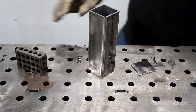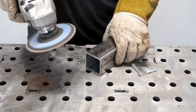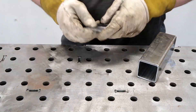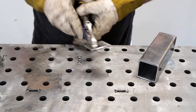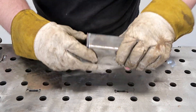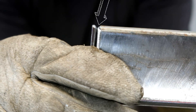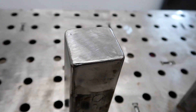Now for the proper way to execute our top or outside cap: bevel or chamfer all four sides at about a 45 degree angle, leaving a slight landing at the top of the tube. Repeat the same process on your cap. Assemble both the cap and your tube with the bevels facing towards each other. This will create a nice valley for your weld to lay into, allowing you to surface grind without removing the weld in its entirety, leaving you with a clean, strong finished outside cap.